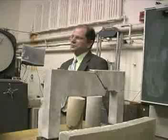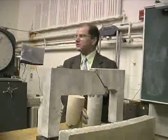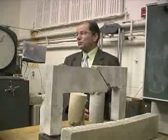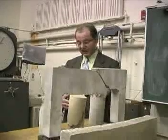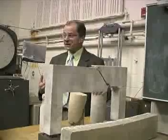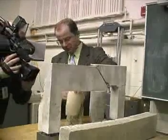He points to some key features, which is concrete — this piece of material here — is very weak in tension. Therefore, when the material is not properly reinforced, and if you look at the pictures coming from Haiti, what we keep seeing is this 45-degree type of failure.